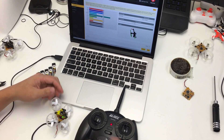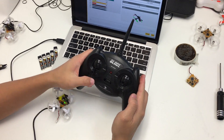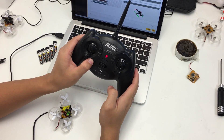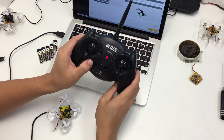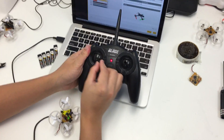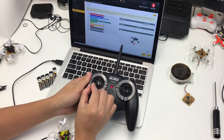The first thing we need to do is reverse that. To do that with this radio, you're going to turn it off, then hold down the inside button and power it on — just keep holding it down. You'll hear a sound, and that's going to let you know that yaw is now going the correct way.